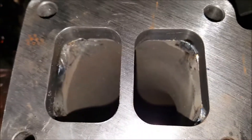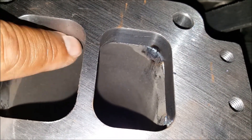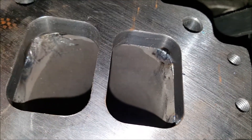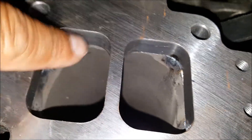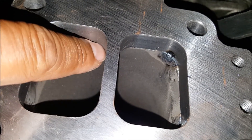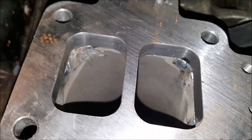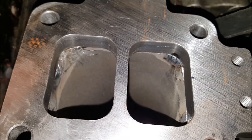I just need to weld the outside and then see if I can use the material that's already there. The only issue is that the flange is thicker, so you've got to put higher heat to get it to melt — but then once you hit this thinner section it could possibly blow a hole, because thinner material requires less amperage.